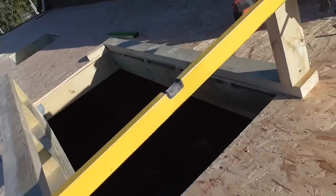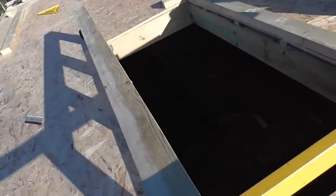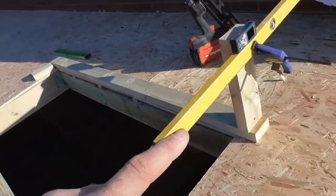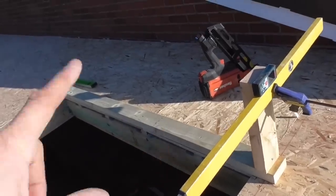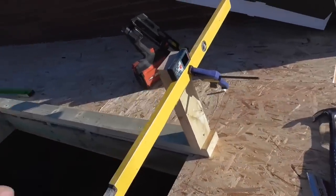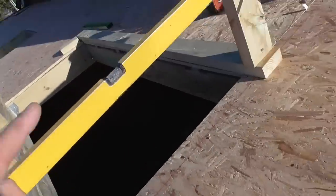I'm just going to show you how I've set a plate up on the back there. I built this one in a frame and nailed it up, but obviously I can't do that on this back one because behind the curb there humps up because we put those spacers on. So what I'm going to do is get the height each end, put a noggin each end, put my level across, and then measure down. But I'm just going to show you how I've got this measurement.